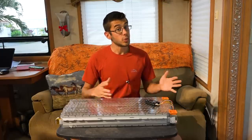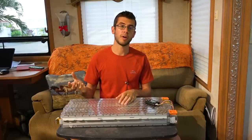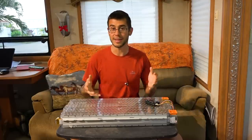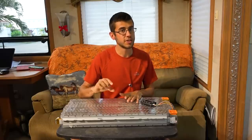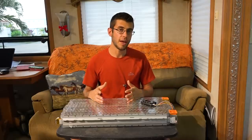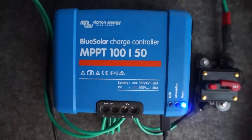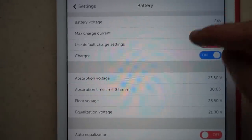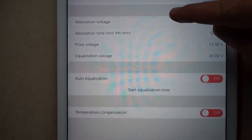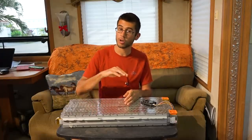We're going to be using a 24 volt system in our RV going forward. We have a 24 volt inverter already, and we're going to be using a 24 to 12 volt converter to power our standard RV lights and components that are already 12 volts. This battery is primarily going to be charged by our solar system. Because it has such strict voltage charging requirements, we got a charge controller that we can strictly set to the voltage we want it to charge up to and no higher. The controller we're using is a Victron Energy MPPT charge controller — you can easily via a Bluetooth app go in and change the voltages to make it exactly what you want. Our inverter is also a charger, so if we're plugged into an AC source we have full control over the charge characteristics as well.